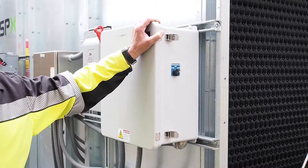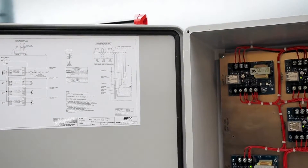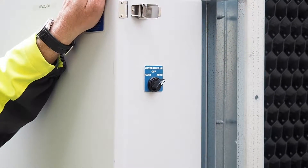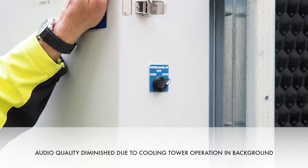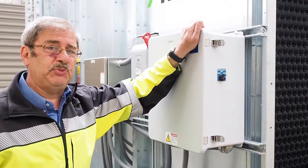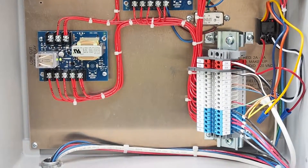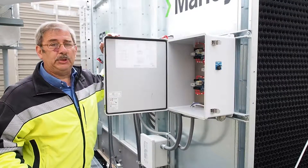This panel contains wiring and a schematic with all of the electrical concerns and dimensions needed to service the panel. Importantly, this is the HOA or hand-auto switch. This switch allows the system to operate in two modes: off and hand, which will manually activate the solenoid valve bringing makeup water to the specific tower, or automatic, where we rely on the control circuitry and the probes inside the cooling tower cell to activate alarms, limits, and the makeup componentry included in the liquid level control system.